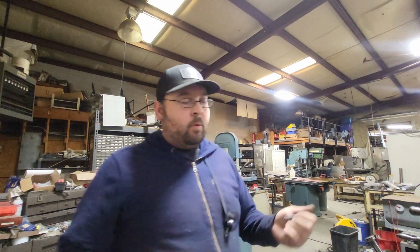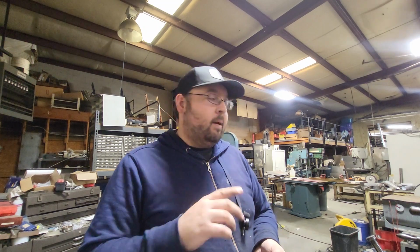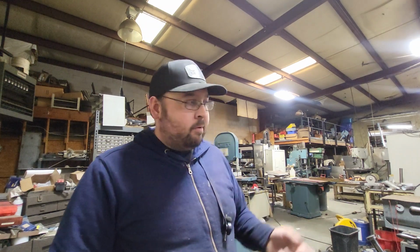But yeah, this is it. You're pretty much staying here while this machine runs. Yes, I could have put this in the CNC, but for this one little part, setting the tools up is just about as quick for me to do over here. Granted, the CNC is going to knock it out much quicker in machine time, but I've got to set all the tools up, run the program, and set the part up. Here, all the tools were already set, so it's just much quicker doing it this way. If I was doing a lot of these, there's no way. But for one, and even two, this is the way to do it.